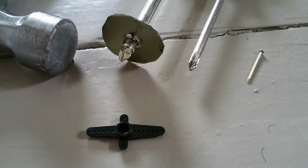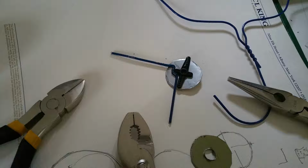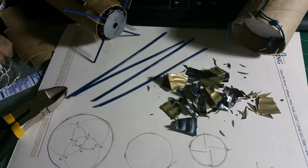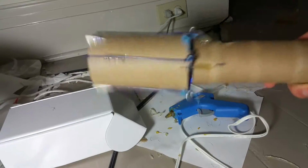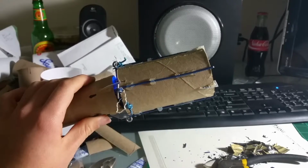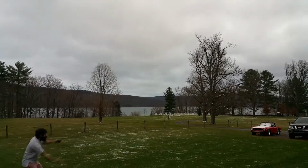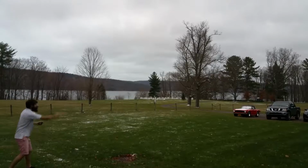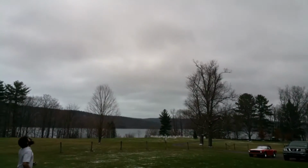I then had to design a new release mechanism that could withstand the ejector's force. Finally, with a solid and exceptionally consistent release mechanism, I started working on testing the parachutes to make sure that they would be at least as consistent. To this end, I created a simple device that would let me release the parachutes and expose them to the air at the peak of their trajectory, rather than getting a head start unfurling on the way up as they would if simply thrown by hand.